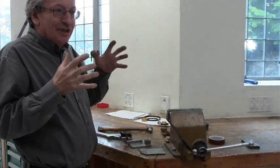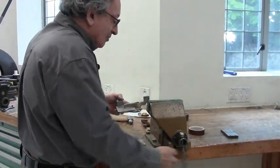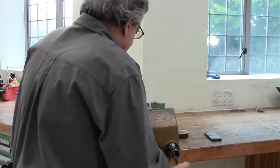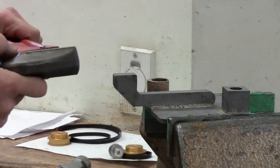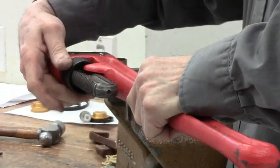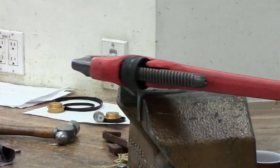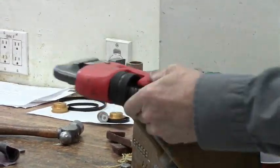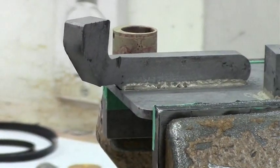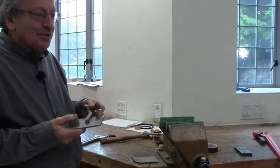That's why cast machinery is so heavy — because the material is actually not strong. On the other hand, if I take the casting built up by brazing and do the same test, I should be able to bend the metal without actually breaking the joint. Let's put a big wrench on it. You can see it's much stronger than casting, both for regular stress and for hammering. So altogether it looks nicer, is much stronger, and is more versatile.